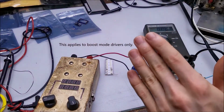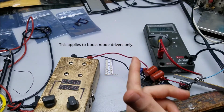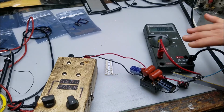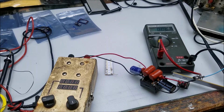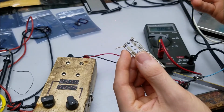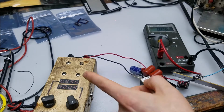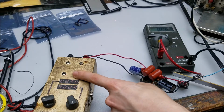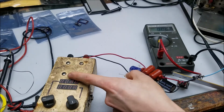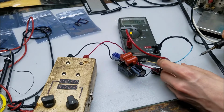Never exceed the input voltage of the load that you're trying to power with your power supply. Always keep the output voltage on your load higher. To show you this, I'm going to put in this. It's going to raise up the forward voltage of the load up to about 8.5 volts. And we're going to see that it'll regulate better because our forward voltage going to our load is higher than the input voltage. So go ahead and show you that.